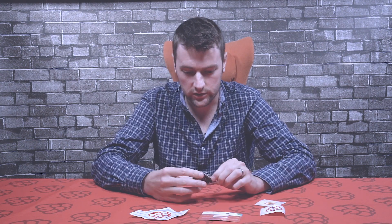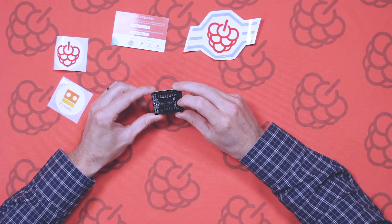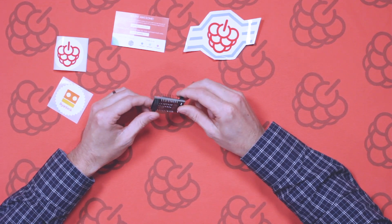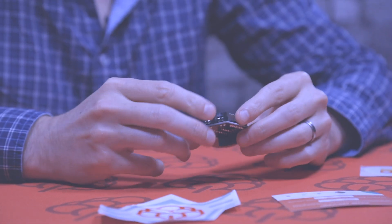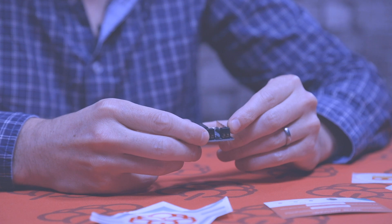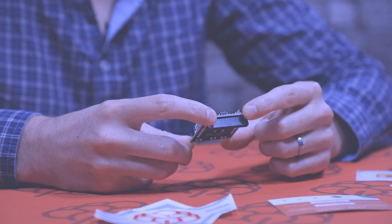So let's take a look at the main board itself. This is based on the Texas Instruments SN754410NE, which is a very common motor controller chip, attached to the breakout board designed by Ryan. As you can see it's got some screw terminals — one for the power here. You can connect up to 12 volts maximum with a one amp power supply.